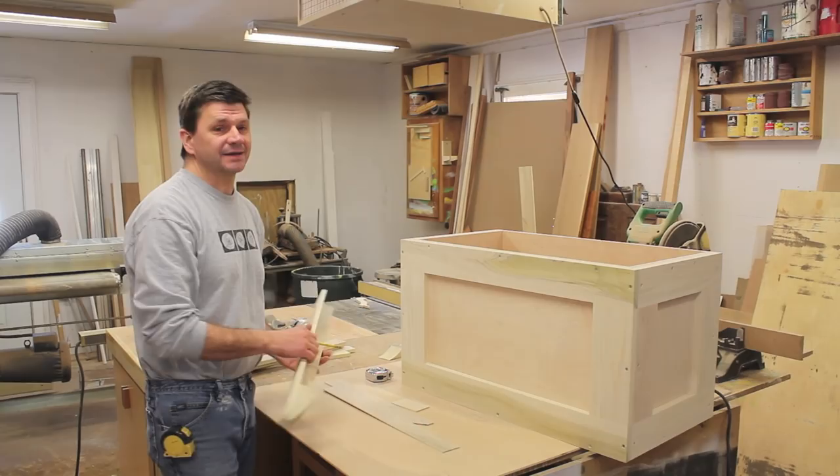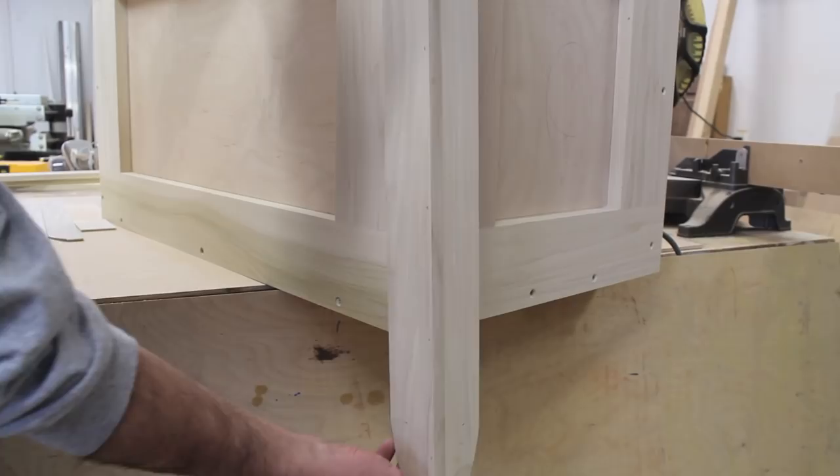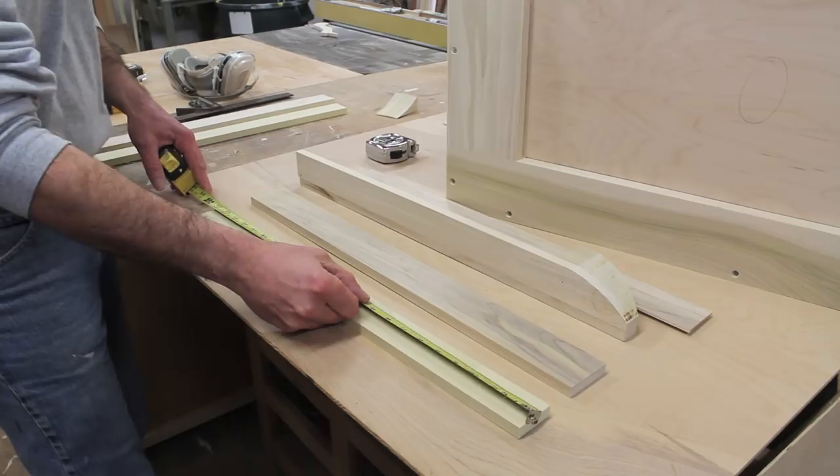I've made one of the legs and they're not hard but it can be a little confusing, so I'm going to take my time and show you how I made the legs step by step. Before I get started building the legs I thought I'd show you the finished one so you have an idea of what I'm going for. The first step was to cut four boards at two-and-an-eighth and four boards at one-and-five-eighths, then re-saw them at a half inch. The overall length of the legs would be about 22 inches, so I cut these heavy at 22 and three-quarters.